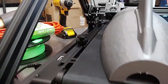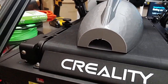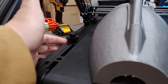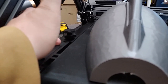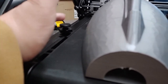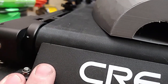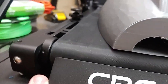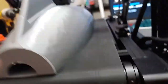Mine did come with one small issue: the belt kept driving itself to the side. Couldn't figure out why until Carl, the guy who helped improve this machine, noticed that this plate was sticking up. This plate sits inside a CNC-milled channel in the extrusion, and mine was sitting up — it must have shifted during shipping. When I unscrewed all four bolts, lifted it, and pushed it back down, it fell right into place, and my belt stopped trying to bias itself toward the left. It was so bad the belt was riding up the wheel, and now it has stayed a consistent distance the way it's supposed to for this entire print.